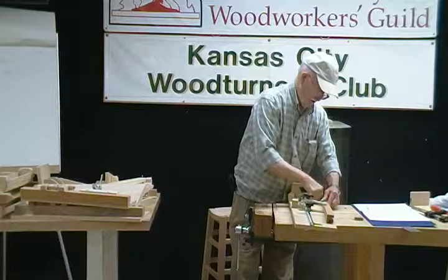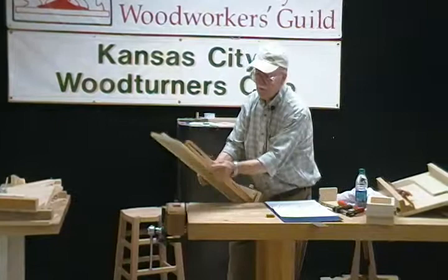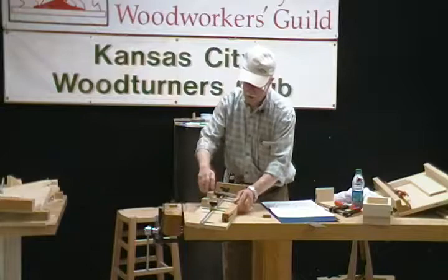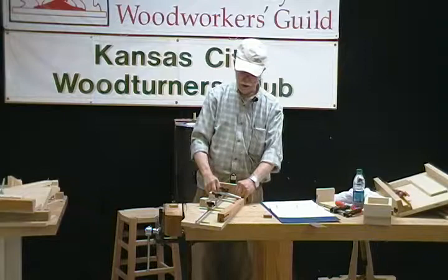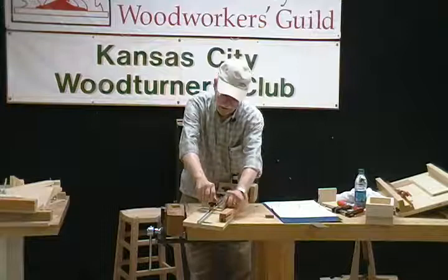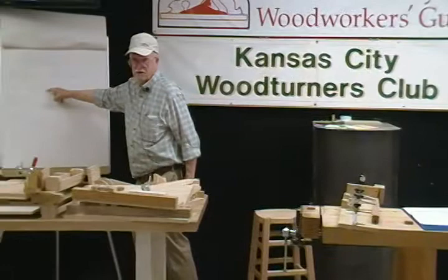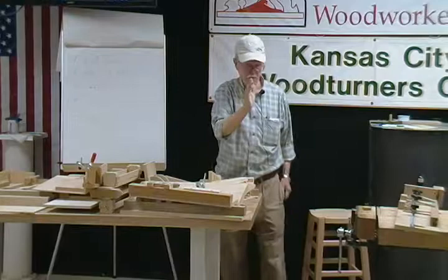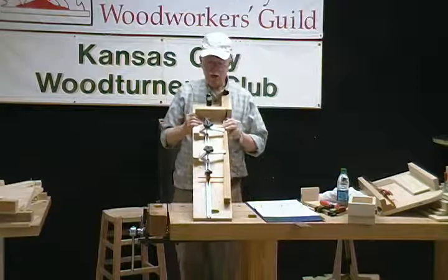You line it up like this — take that mark on the bottom and line it up where your blade is going to cut right there, and take the line where you marked the taper to start and line it up there. You clamp it down like this, and when you clamp that down, this jig has adjustable stops you can slide up. I have established my fence, because the fence determines your relationship to the blade. Now I have that clamped down and I can run through the saw and cut that taper.